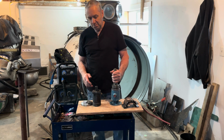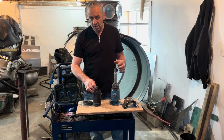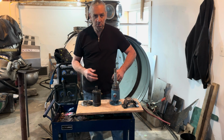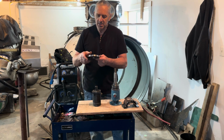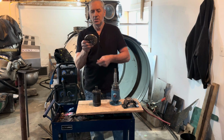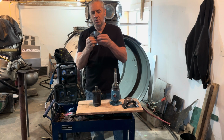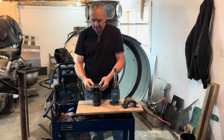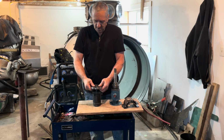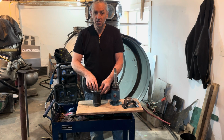I hate it. Plus, I may be changing motors often to get the ultimate combination between pump and motor and propeller. So what I did, I made this adapter piece. So this is simply a steel plate, and I machined an O-ring groove. So it takes that O-ring, and then this piece here slides over the motor, boom. It seals to the motor now with an O-ring.